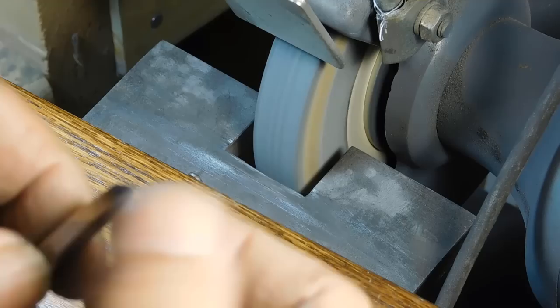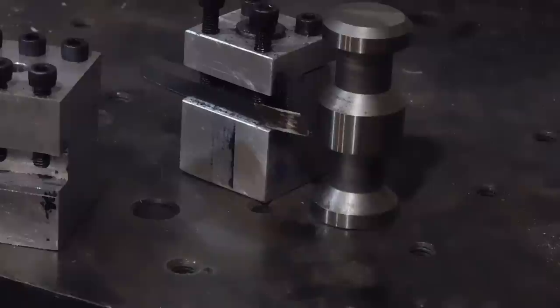Okay, just wanted to give you a good look at that tool post holder. It holds the tool upside down on the rear side. The first hob I made had a 20 degree bit, and I didn't have any trouble with the plunge cuts with that, but with the 14.5 bit I had all kinds of troubles, and I messed around with my bearings in the head and the tailstock. I tightened the gibs up.